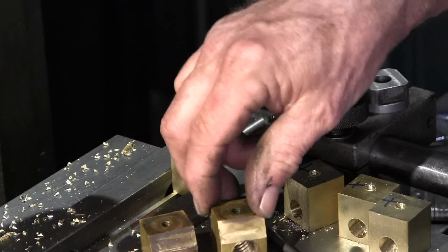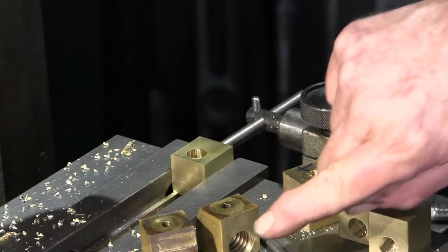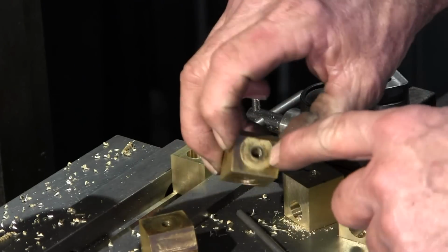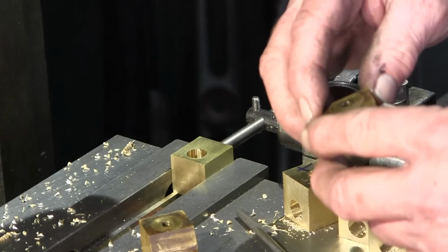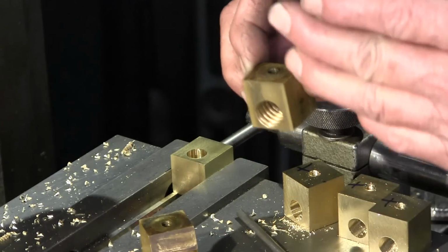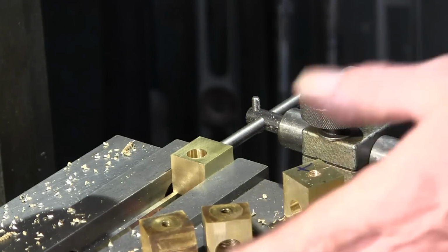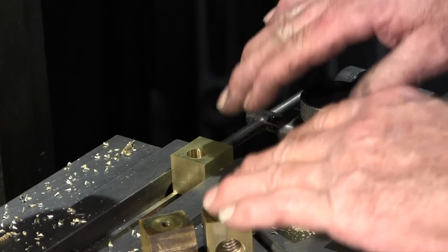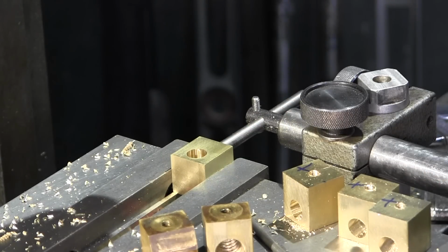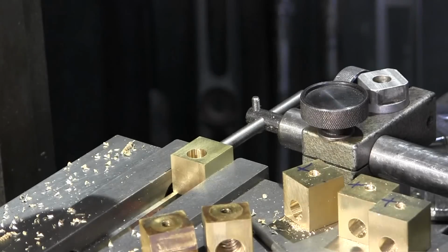I'm giving it some thought right now to eliminating this wedge and drilling through and putting 2 set screws that bypass this thread going down through here, and spread the two like a regular nut with a wedge cut and then a spreader bar on it. I'm going to play around with that, probably finish that up tomorrow, but for right now we're going to try to get our Acme thread started in these holes here, and we're going to see if we can do it with this tight hole here. This will start, but it's going to be tight.